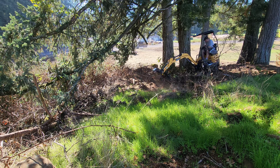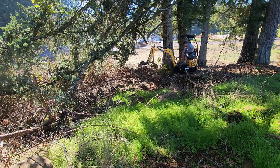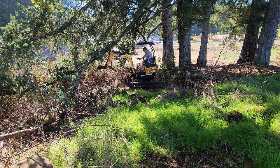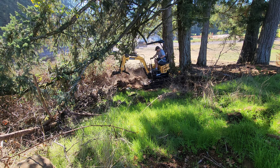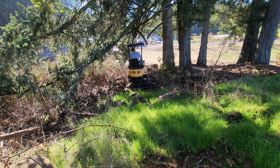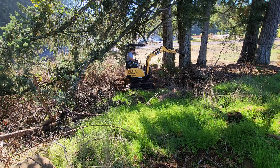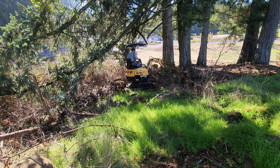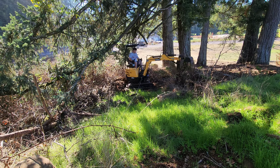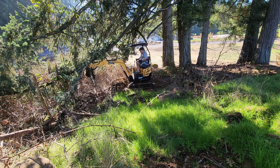It provides a little bit smoother operation. Now, compared to a Kubota, a Yanmar, or a bigger excavator, it's not as smooth, it's not as precise, but it is more refined and smoother than what you find on a one-ton excavator where you are running the valve control body with the handles. So it does add a little bit of finesse where there wasn't any to begin with on the 2,000 pound units. Those are the main differences, just the pilot controls and bigger pump.